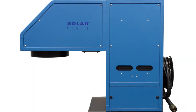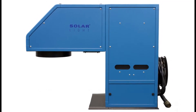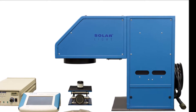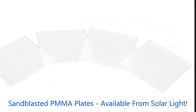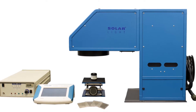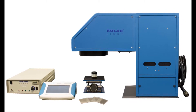Solar Light simulators in the LS1000 series are high-precision turnkey testing light sources for professional and laboratory applications. The LS1000-4S009 is a complete light source package for pre-irradiating the PMMA plates used in broad-spectrum in vitro testing of sunscreens, as defined by ISO and the FDA. The emission spectrum follows the latest ISO and FDA guidelines. The light source has a 4 inch diameter vertical square beam, which is large enough to completely irradiate up to four 2 inch square molded or sandblasted PMMA plates simultaneously.